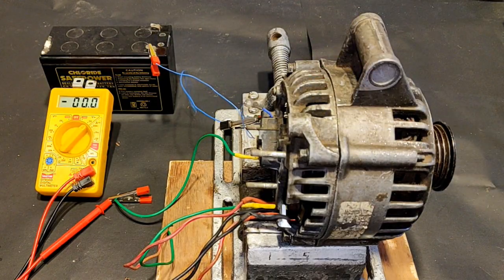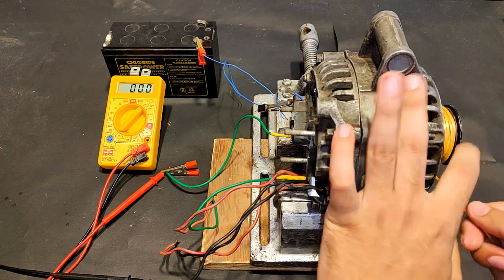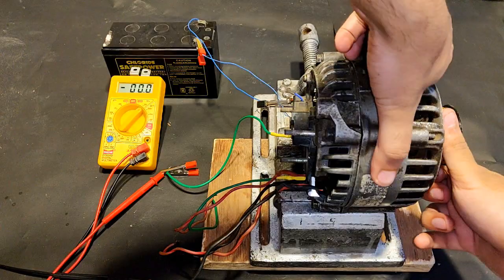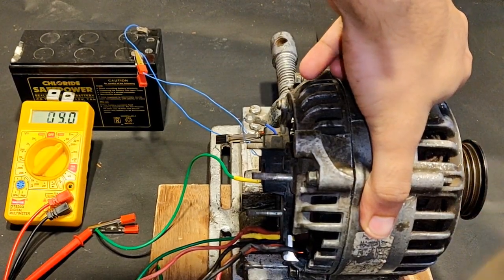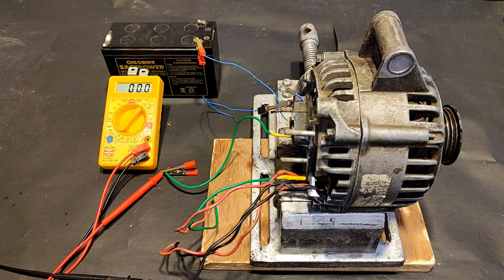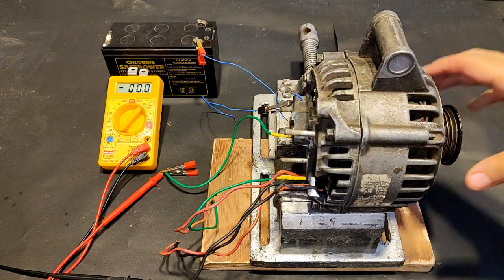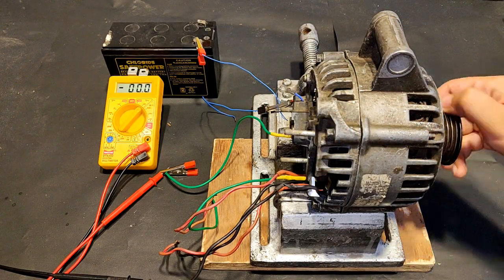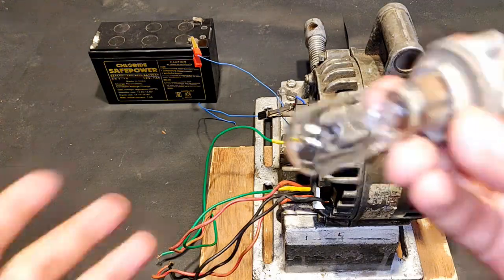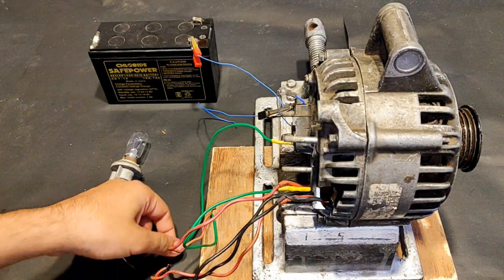The maximum that I did was three volts with hand rotation. The thread has been wound and I have to touch the terminal to the battery. The connection has been made — as you saw, I generated around 14 volts AC with the help of this alternator with simple rope rotation, which is really awesome. This means the series connection modification is actually working. At a little higher RPM, somewhere around 2000, it is going to produce 36 volts. This Royal Enfield headlamp bulb is what I'm going to use to connect to this alternator and test its power.